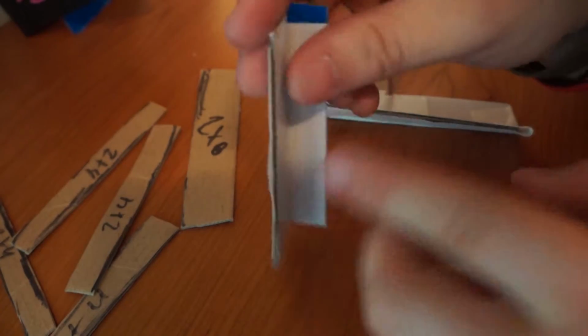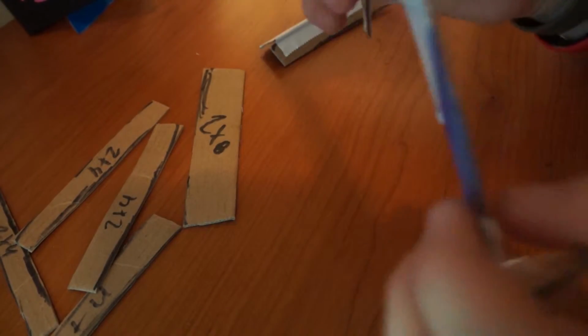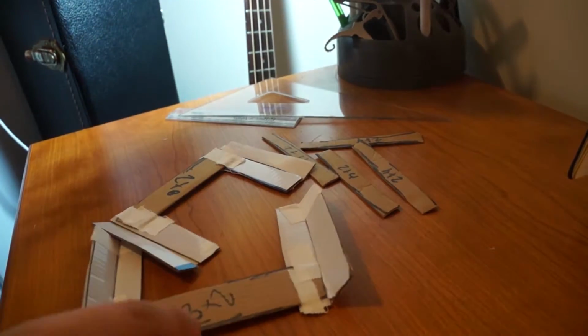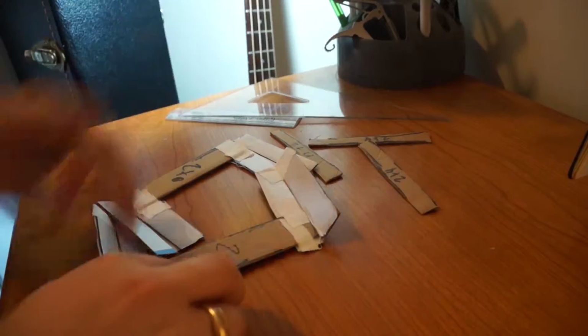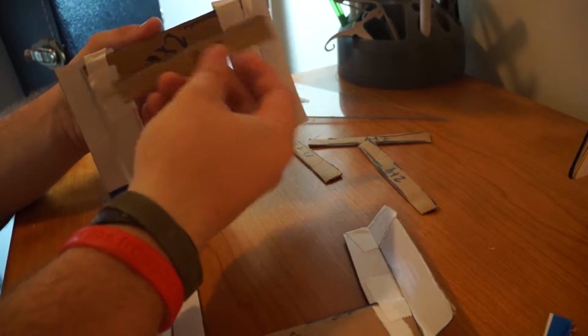And each of those, so we'll have four of those with each longer piece, the 2x6, facing inwards to make it so as if each side is equal. From there, you attach a 2x8 in between two of the corners to make the long width of the bed. So with two sides, I'd be able to then create a cross beam in between each one. It would be shorter than the length of the bed, probably about half. So we'll have to cut these 2x4s in half.